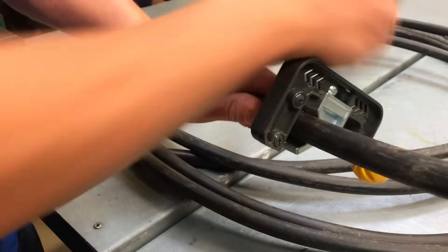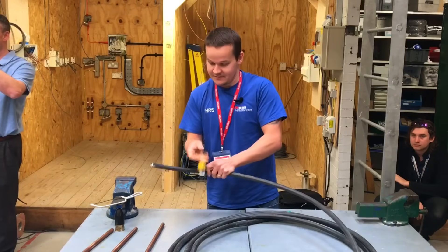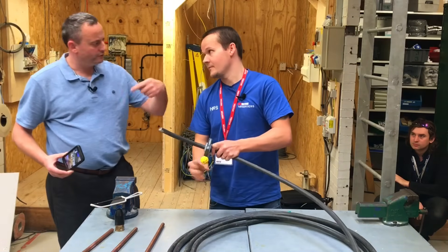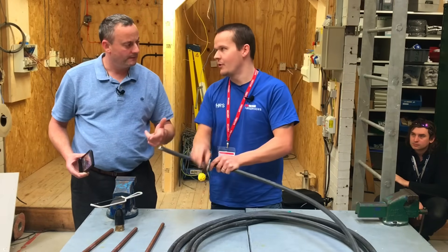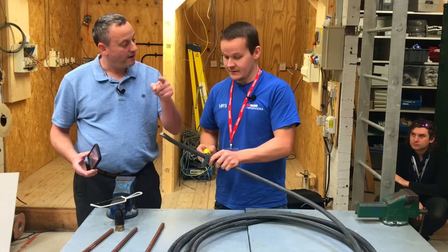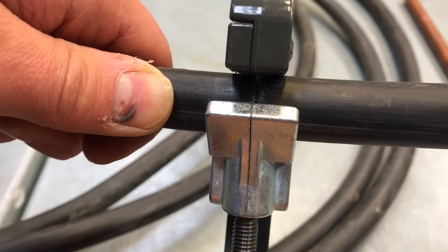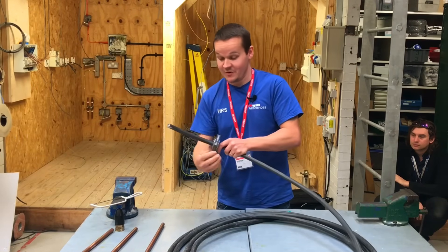Chris wants to demonstrate this quickly. The sound is just like a hacksaw cutting round. The technique is to keep tightening the tool slightly — about a half turn — after every couple of rotations. If you go too fast you'll just drag the steel wire armour. There's a little window on the tool so you can see how much you've scored through — once you can see you're roughly halfway, you know where you are. When happy with the depth, take the tool off.